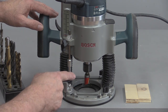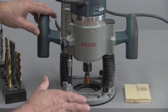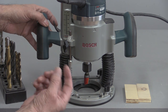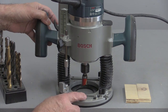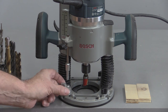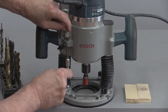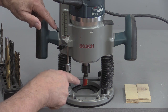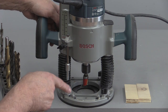In a moment I'm going to use this router bit and cut a dado, and I'm going to show you how you can cut it absolutely perfect every time. Because I'm cutting a dado, I need to have a certain depth and I like to use 3/8ths. With most routers they have something called a turret and it's got different steps for height and depth adjustment. What that allows you to do is after you bottom out the bit, you can actually set the depth very accurately.